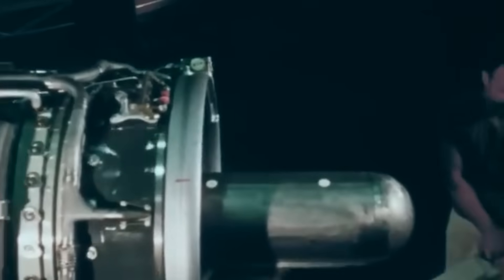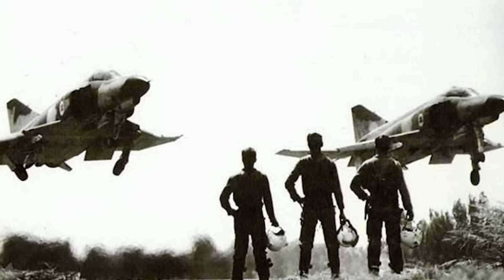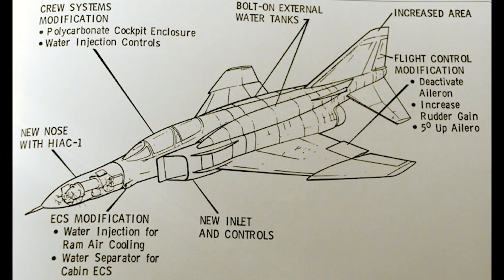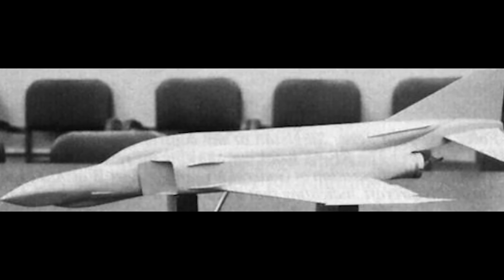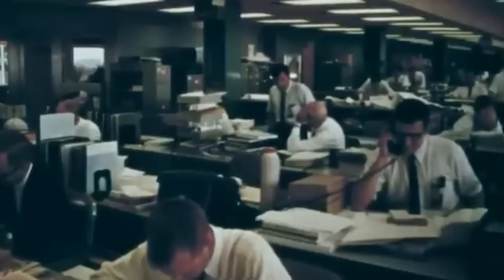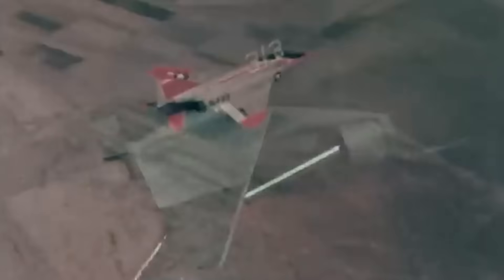At the same time, General Dynamics were contacted by the IAF to assist with their reconnaissance dilemma, and a smaller separate research program was begun, codenamed Operation Peace Jack. Working with the US Air Force, concepts of this new Phantom were sketched out and mocked up with papier-mâché. General Dynamics started developing the concept by installing 300-gallon conformal water tanks above the fuselage engine fairings. Using demineralized water, the goal was to provide pre-compressor cooling — by injecting a mist of water in an early stage of the engine, air would be cooled before entering the compressors, increasing the density and mass flow, which would help especially at high altitudes and increase oxidizer to the afterburner.